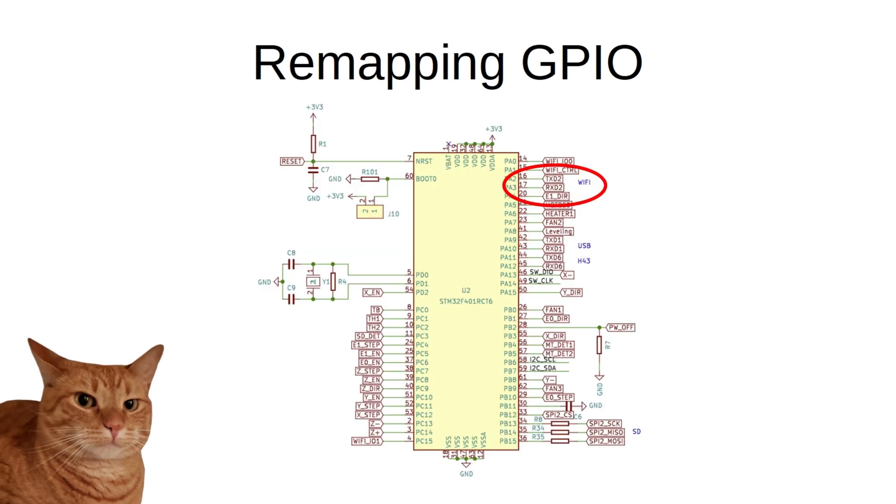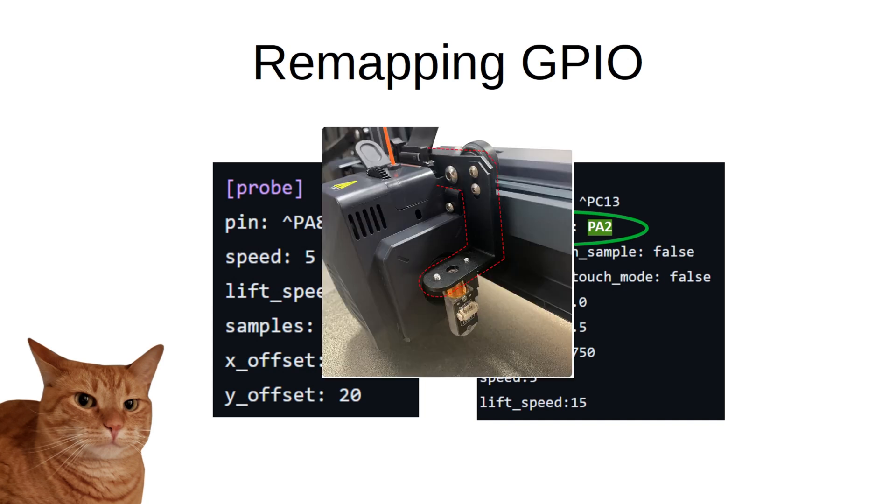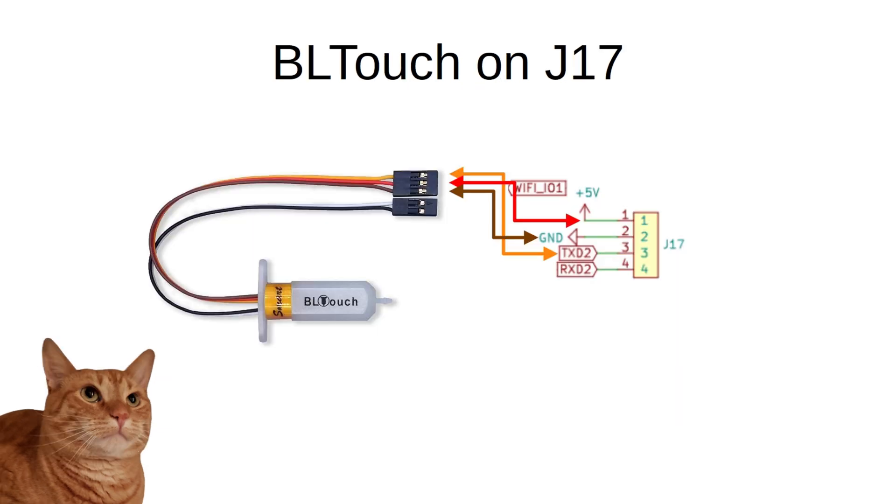If we trace those pins back to the pin assignments on the STM32, we can see that they are located at pin locations PA2 and PA3. Knowing this, if we have a Neptune 3 Pro, Plus, or Max running Klipper firmware and would like to connect the BL-Touch to replace the inductive probe, we can simply change the probe section to a BL-Touch section, fill in the additional information that a BL-Touch requires, and make sure that our pin assignment for the control pin is either the TX or RX pin. When it comes to wiring in the power and logic portion of the BL-Touch, we would simply connect the pins as shown, which on a standard BL-Touch cable would require swapping the power and servo wires inside the DuPont connector, but everything should work properly on reboot as long as you've got the Z-axis limit switch wires plugged into the correct slot on your MCU.